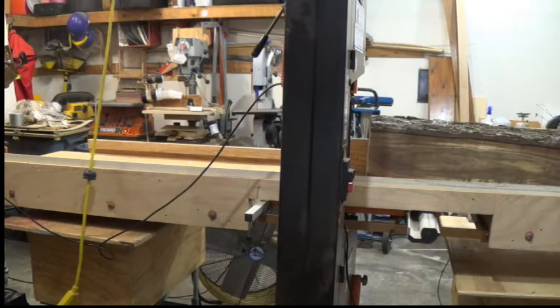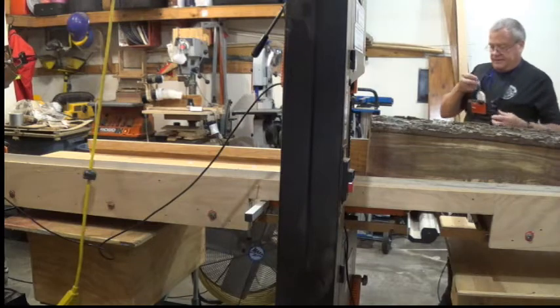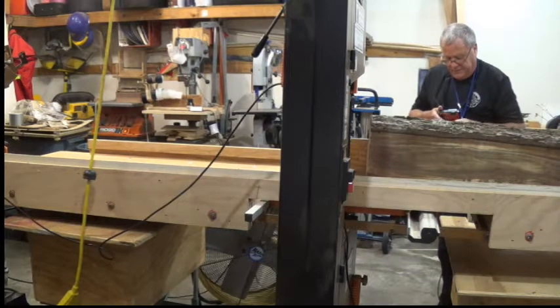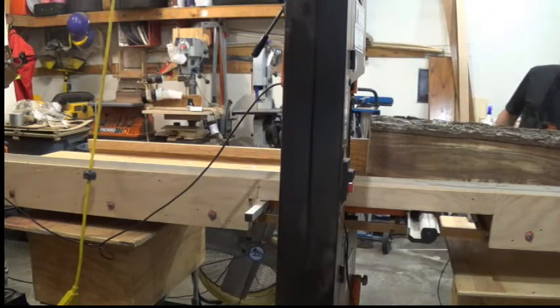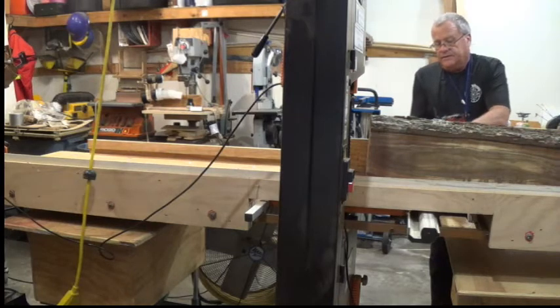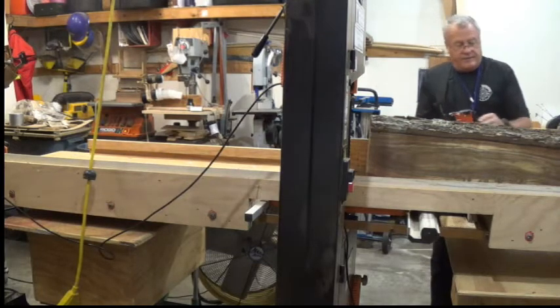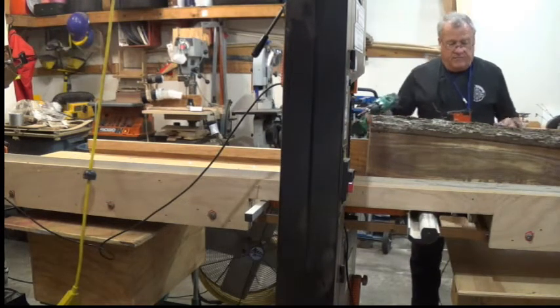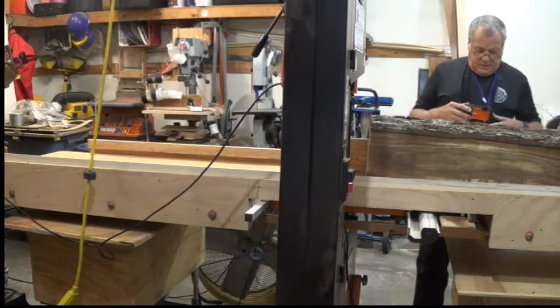And there's another slab, so I'll turn that into firewood. You sit there and look at that walnut and you go, wow, that's some beautiful stuff. The nice thing about having your power to your mill on a remote fob is you can turn that off real easy. It's basically on a lanyard that's around my neck. I've cut the cord in half and taped it together with masking tape so it's like a fusible link — it'll break if something gets hold of it and break it right off of my neck.